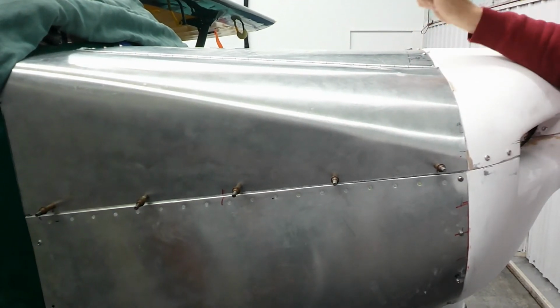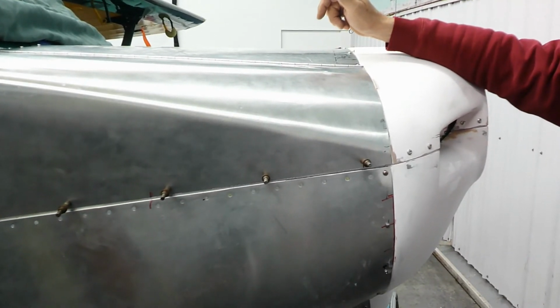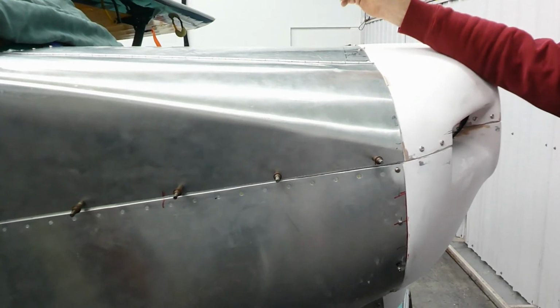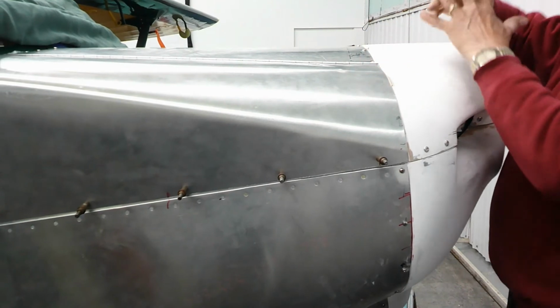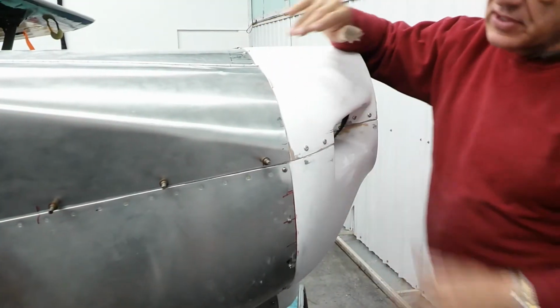It really makes it super easy, especially if you're only doing something on the top side of the engine, just something minor, or you're looking at the magnetos at the back or something. You don't feel like taking the bottom off, you just pull the 8 screws at the front of the nose bowl, and you pull the screws at the top of the cowling.